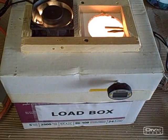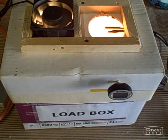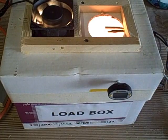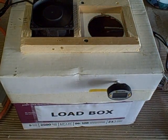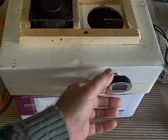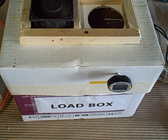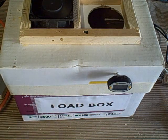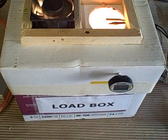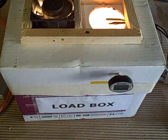The actual temperature inside the box is not really that important. What we're interested in is the difference in temperature between the ambient temperature and the load box temperature. That's just about 64 degrees — 63.7, something like that. So we're maintaining a temperature inside the load box of 64 degrees. The ambient temperature is 54 degrees, so we have a differential temperature of 10 degrees. That'll make it easy for our calculations.